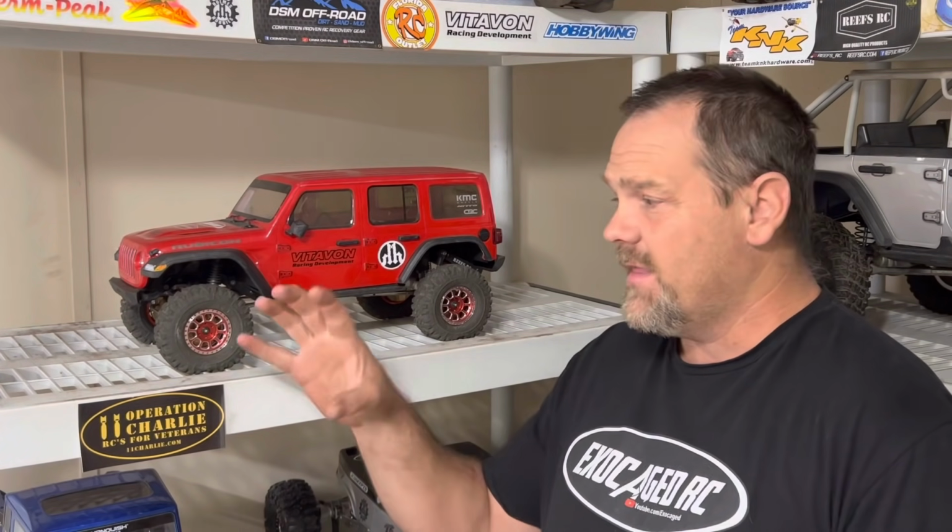Well, it has a spot for active brake control. I'm gonna be messing around with that a little bit more. I saw it when I was doing it, but it didn't really dawn on me exactly what it was. That's awesome. So you could probably tune out a little bit of that flutter it does when a motor's just sitting there. But it's awesome that just through the two wires, it can tell what that armature is doing. I got a feeling this ESC is going to replace every 1080 that I've gotten.